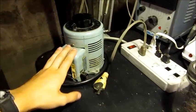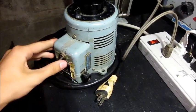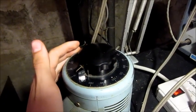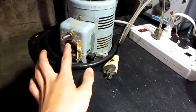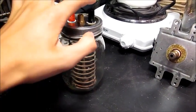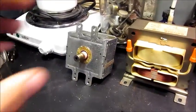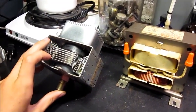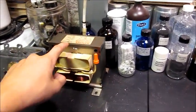Electronics wise, this is a Variac — these are very useful. They're variable transformers with a little switch; you turn it on and you have an adjustable voltage. Mine goes from 0 to 140 volts, some go from 0 to 200 and more, and you just plug into the output right here. This is a hydrogen-oxygen separator — you run a current through it and it produces gas from water. This is a magnetron from a scrapped microwave — I'd never use it without the proper safety equipment. And this is a microwave transformer.